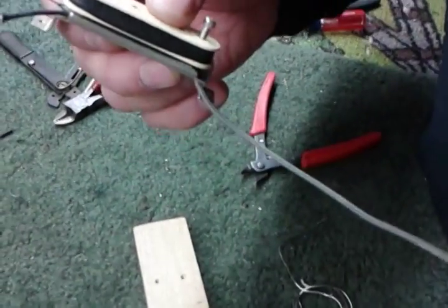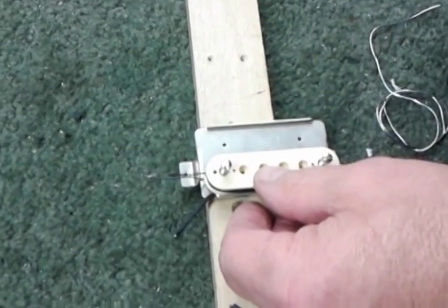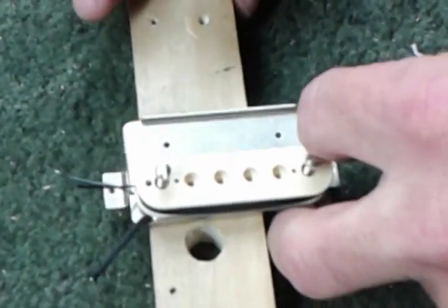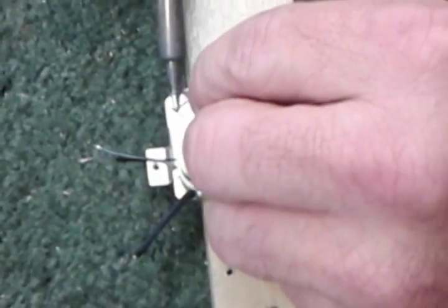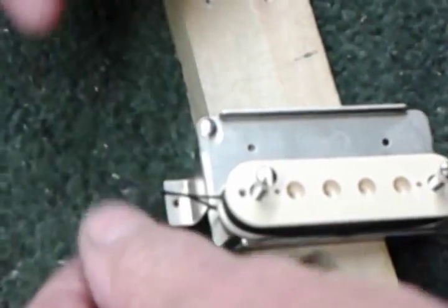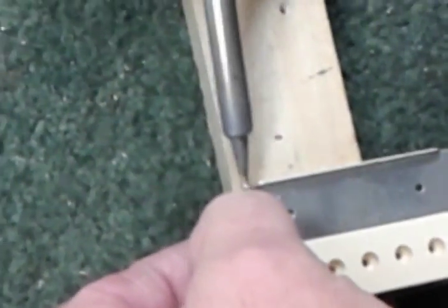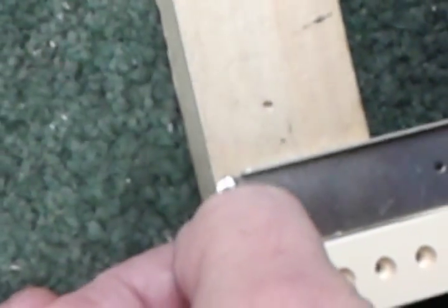For ease of doing it, and it works fine, I'm going to connect over here underneath the corner of the slug bobbin — and that's why the slug bobbin's not mounted. I already pre-trimmed the wire and tinned the tip of it. I'm going to get a dab of solder going right here, a little blob. See that nice little round blob of solder? Now I'm going to take that pre-tinned wire. That's all it takes right there.